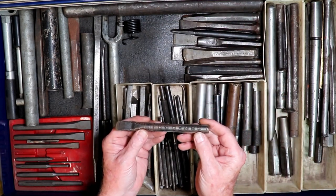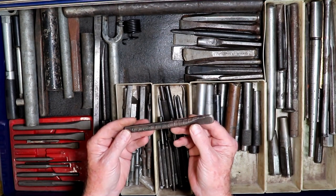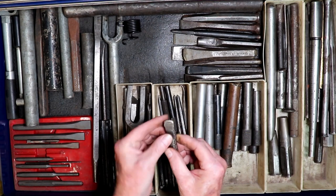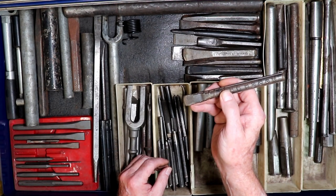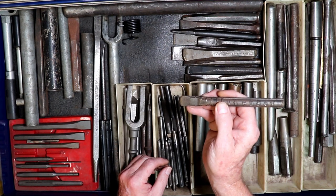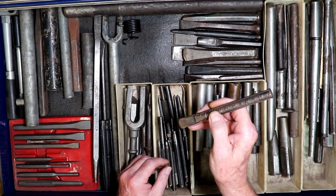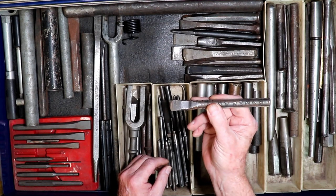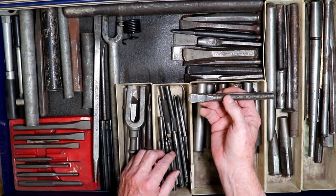Here's that Korean chisel that I made out of rebar, as you can see. But this is with a rounded edge — this is called a walking chisel. You take and put your chisel on a line and tilt it back slightly, make a hit, then stay in that groove and walk it slightly forward, make another hit, walk it slightly forward, make another hit, then twist it back and pull it until it stops, make a hit. And you can make a very straight line with that, as long as you keep the chisel point engaged in the groove that you've already made.